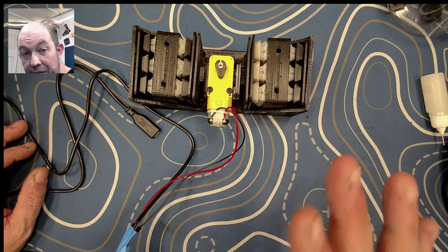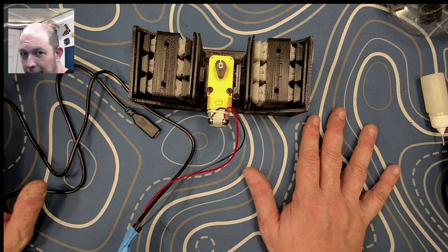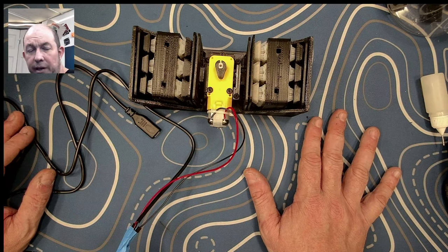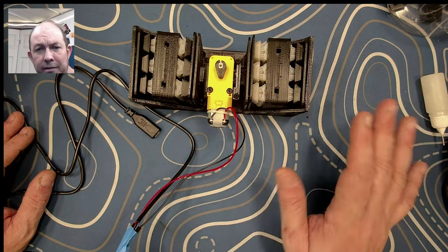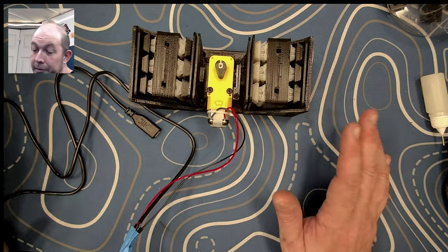And the thing is, the difference is night and day. I ran some plain Gateron yellows that hadn't even been lubed through them for roughly 240,000-250,000 actuations, and boy, it's like glass on glass now. I mean, there's some spring ping, which I can fix with a little bit of oil, but there's no need for lubrication on the rail stems. They are like glass. It really does make a difference.